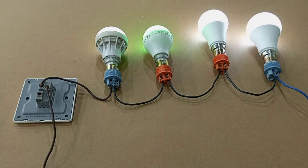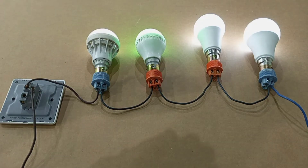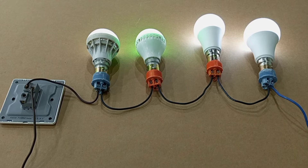If I operate this switch, all these lamps should come on. But you can see that this is actually not the normal brightness of these lamps, because they are connected in series and have to share the voltage. The total voltage from the source is divided among these lamps, so the more the lamps, the lower the voltage across each lamp. When resistors are connected in series, their resistances add up, and the more resistances in series, the lower the total current. The total voltage is divided across the various lamps, giving a reduced voltage across each one.